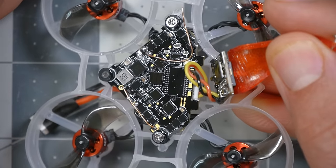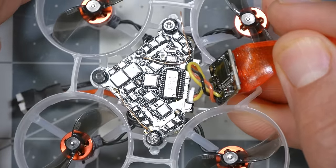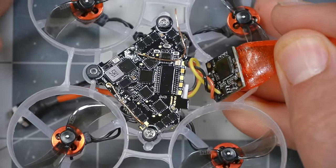Other than that, go hog wild. Once you apply the conformal coating, how do you know you got it everywhere and didn't leave a bare spot? If you look at the board under a bright light, you can clearly see a shininess that the conformal coating leaves when it dries. Another way to check — if you have a UV or black light, the conformal coating shows up very clearly under black light, and that is a more certain way of checking that it got everywhere it needs to be.